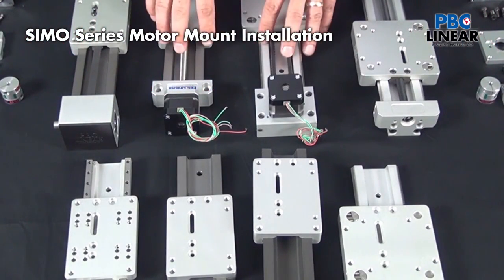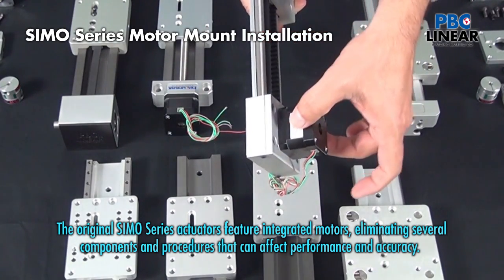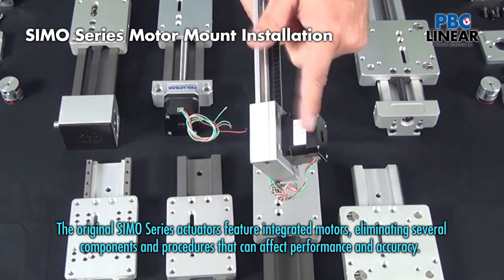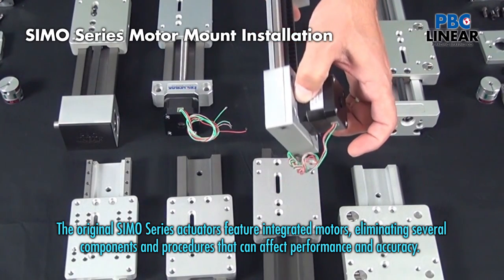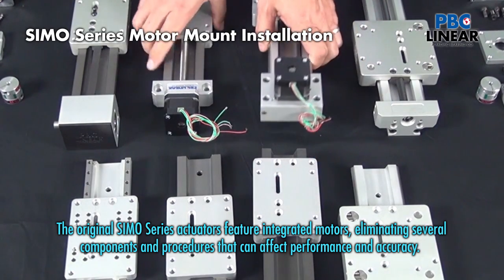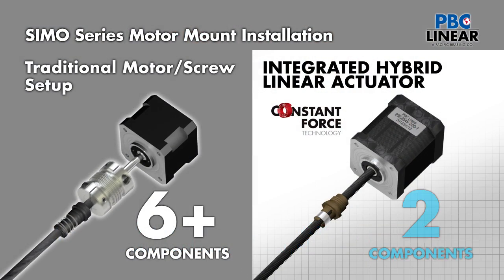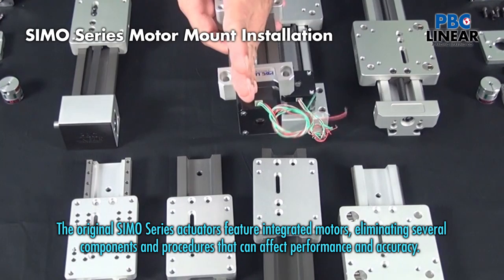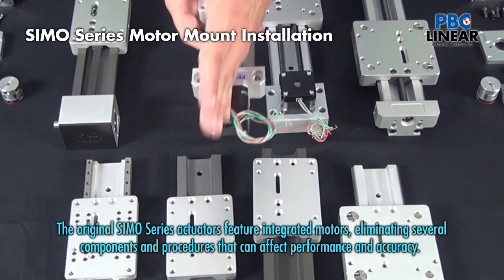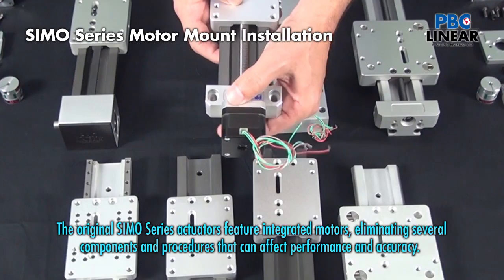In this video, we're going to concentrate on how to attach a motor. The original design has an integrated motor — here you'll see the motor attached directly to the pulley housing for the vertical belt drive. There's no coupler in between, so you get a very rigid connection with no backlash or play. Same with the lead screw design: no coupler, with an integrated screw laser welded directly into the motor for direct alignment and pre-engineered centering.